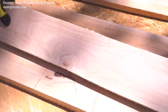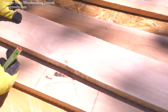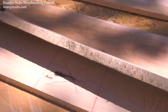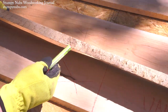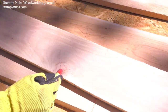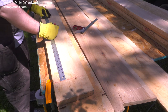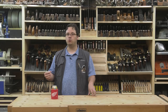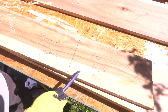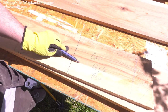Some knots can't be used though. This one doesn't go all the way through the board, but look at how the grain around it twists in different directions. You can see the effects of this by looking at the edge of the board — there's a slight bend right where the knot's located. Those crazy grain changes might look cool, but they make this part of the board unstable, especially because it's so close to an edge. It's better to cut it out than take the risk of the project part warping later. I like to use a long metal rule to lay out my parts instead of a measuring tape, because it lays flat and I don't have to lock it to keep it from retracting. I'm also using a lumber crayon at the moment, but my tool of choice is usually a thick pencil lead like this one. It's really durable on a rough surface like this, but it'll leave a much crisper, easier to read mark than the lumber crayon. I'll put a link to it in the description below this video.